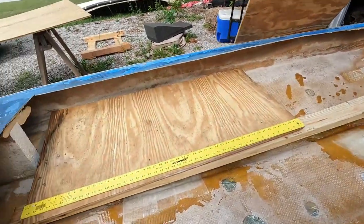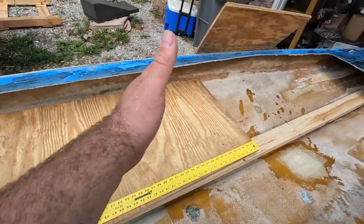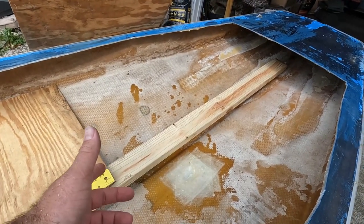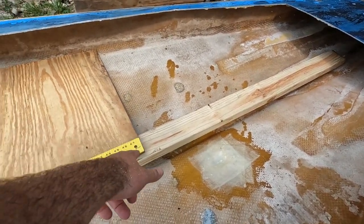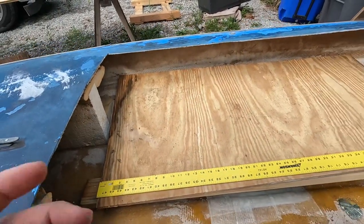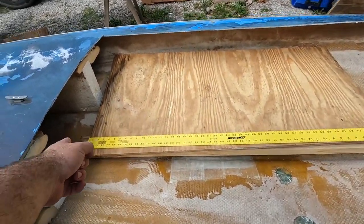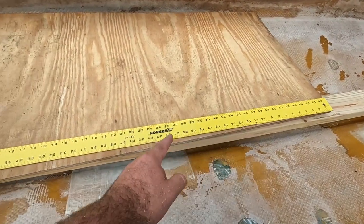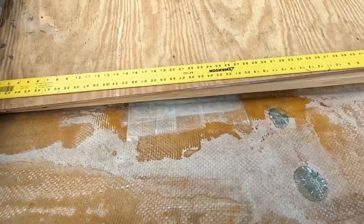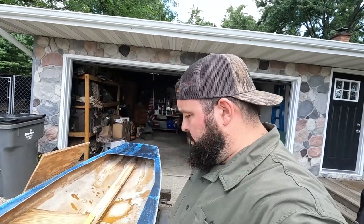I'm putting it on top of a two-by-four. I got four panels right now, and all four panels are going to be both glued and screwed to this beam. You'll see where I'll have to add extra support under the bottom to reach all the way across. The way I'm cutting it is I'm laying these in here, measuring right across the center, cutting that away, and then this slides over to the other side — doing the inverse, cutting that off and moving it over so it fits into place. That's the strategy for that — pro tip — and we'll keep going.